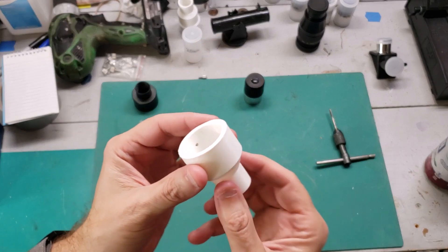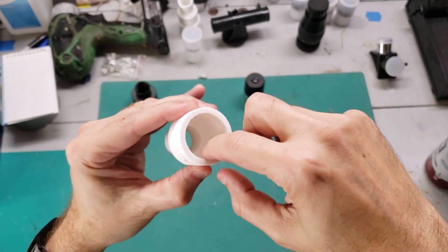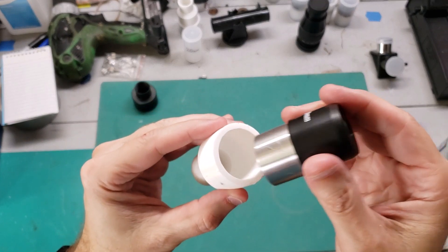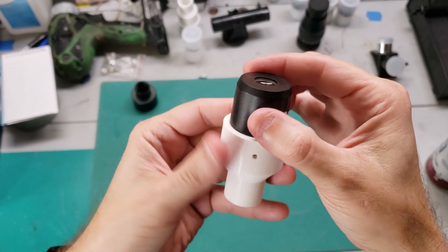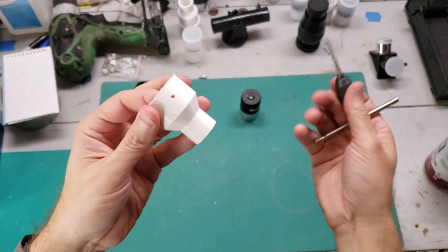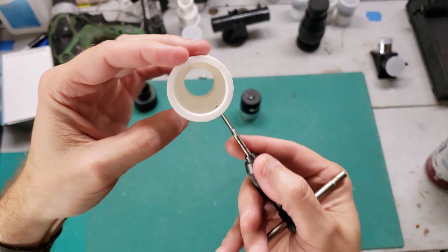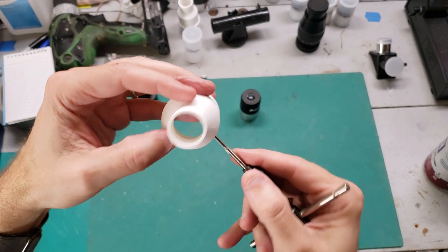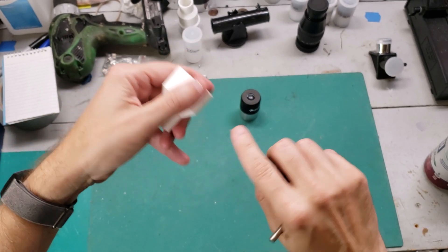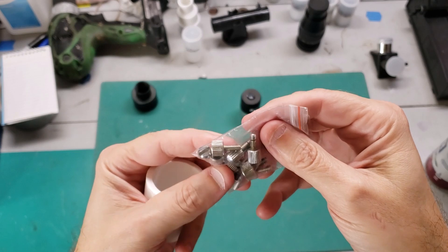Here's the one that we 3D printed. Before you do anything, you need to take some sandpaper and sand off this lip right here, because there is a little bead that typically builds up right there and it won't let this go in. But once you get that done, it should fit right in just like that. This hole in the 3D printed model is sized for a 4mm tap, which is very common for tightening screws on eyepieces. You just put it in there — this stuff is very easy to tap. In fact, you don't want to be too rough because it will actually tear out.